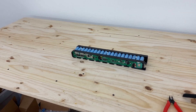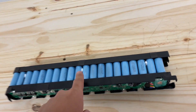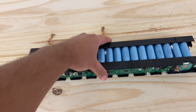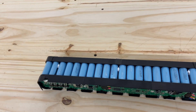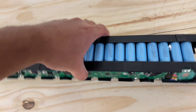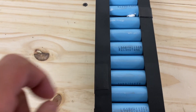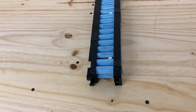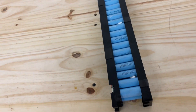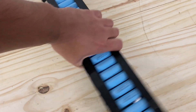Let's talk about these batteries — these are pretty amazing. These are scooter batteries, and right now there are thousands of them. The cool thing about them is that they have some of the best cells I've seen: LG MH1 cells, 3200 milliamp hours. These are energy-dense cells, not power-dense, so they hold 3.2 amp hours each.